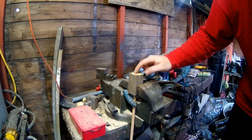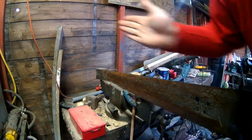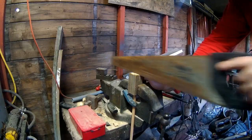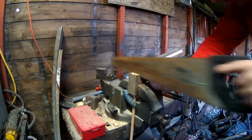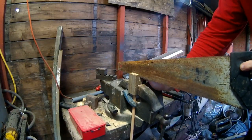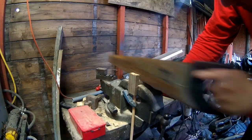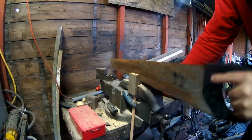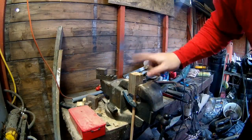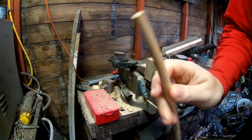You can see this is just a bit of wood. We're slotting it — it's cut down with a hole in for the shaft, just clamped lightly. And we're going to saw with the grain, in the direction of the grain, because we're going to put the horn sliver in here. Let the tool do the work — don't try and rush it because you'll end up ripping out the shaft. I just need to adjust it and lift it up. That's the slot cut.